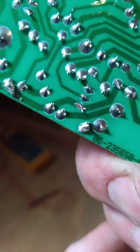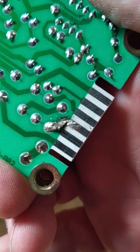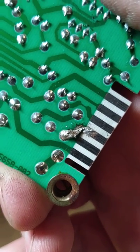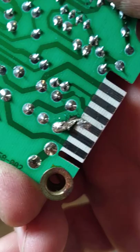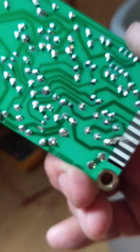So I re-soldered them back together — not a very good soldering job, but that's not the point. And then I found this contact was actually burnt on the board itself. So I took my soldering iron, melted back the plastic, ran a solder bead from there to there, and made the connection again.